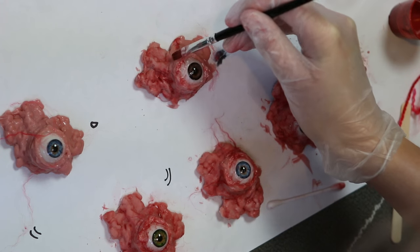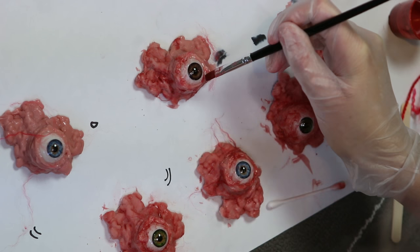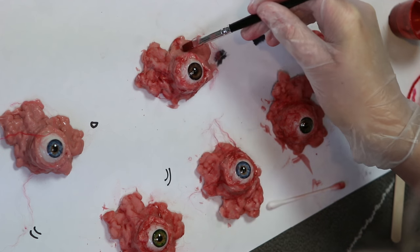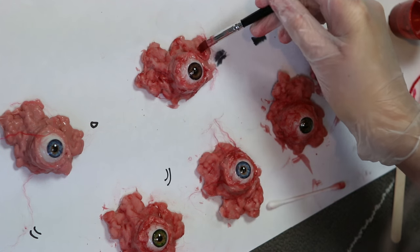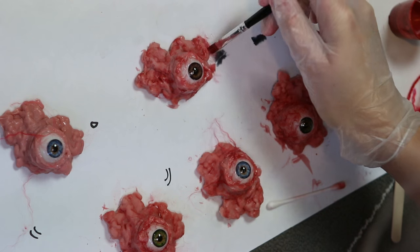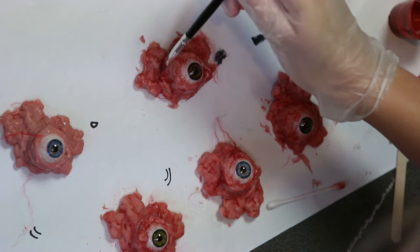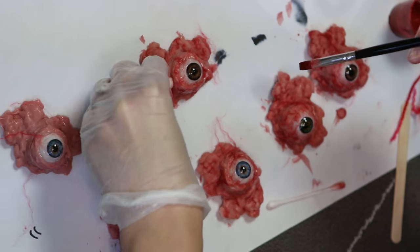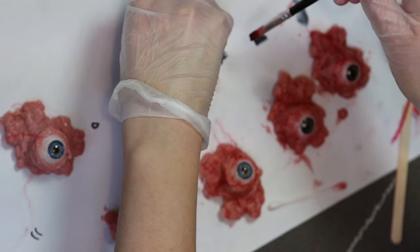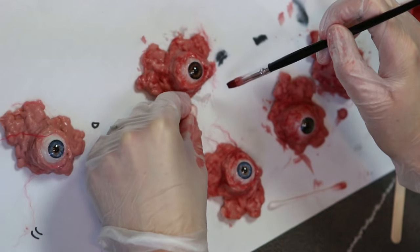The paint is made with silicone so that it will bond to the silicone eye. I'm using Smooth-On Silpoxy — I've squirted some into my cup and thinned it with naphtha, so I'm wearing gloves and a mask while doing this, then added silicone pigments to make that red colour. I don't remember exactly what pigments I used but there would have been some red, pale flesh tone, blue, brown — stuff like that. It's thinned down with naphtha to get light washes of colour, and I'm using a cheap paintbrush because the silicone could easily ruin it forever.